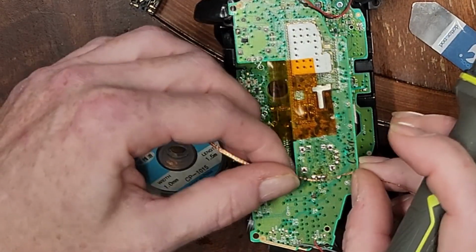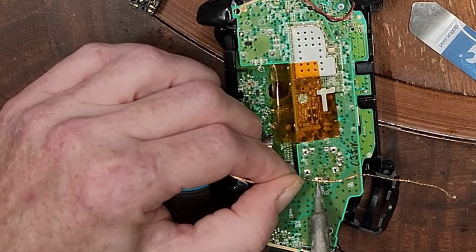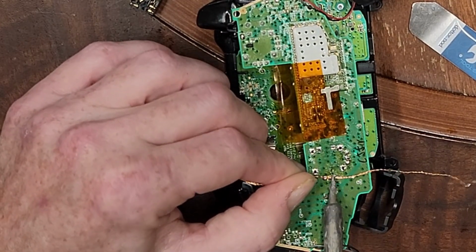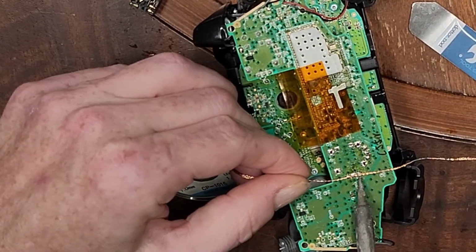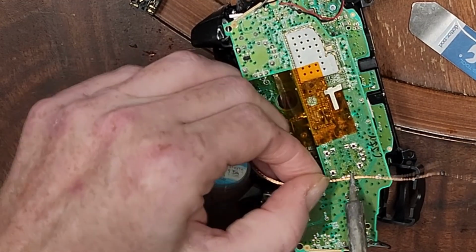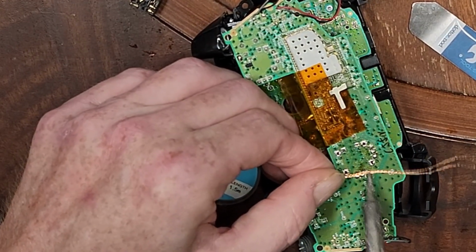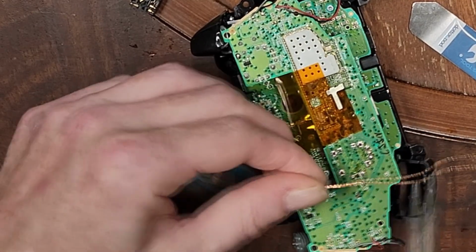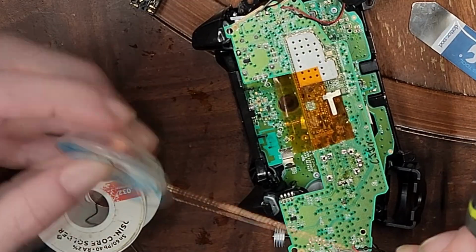But today, I believe there's 3 pins here, 3 holes here. So we can get all that solder we gooked on there off of there. And that's another reason, by the way, we use the leaded solder. It's got a lower melting point than the lead-free crap. And also, once it mixes with the existing solder, you've got overall a lower melting point.